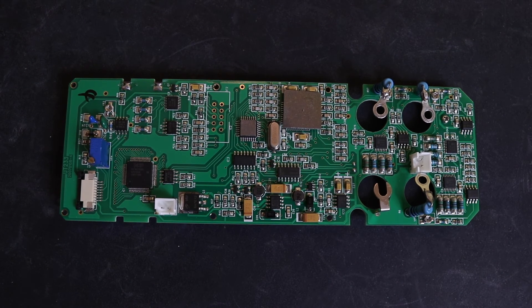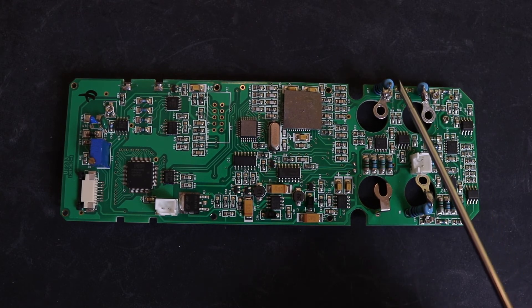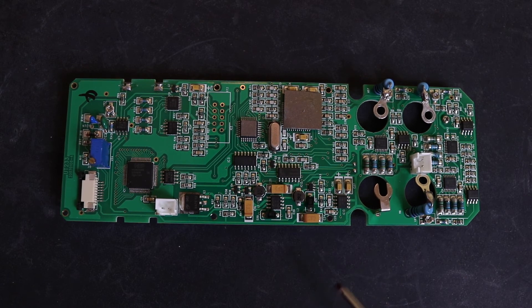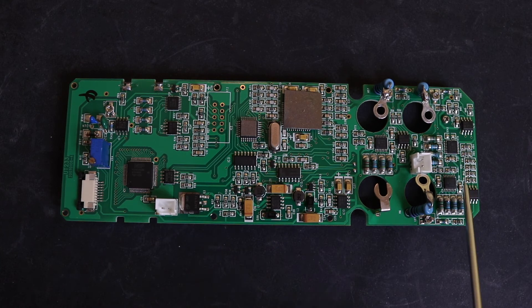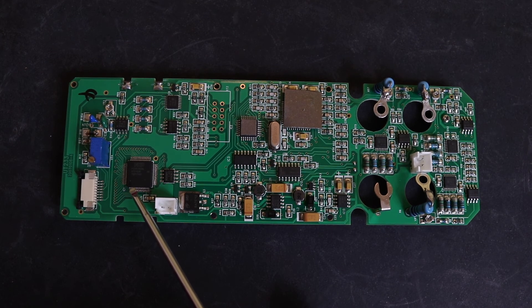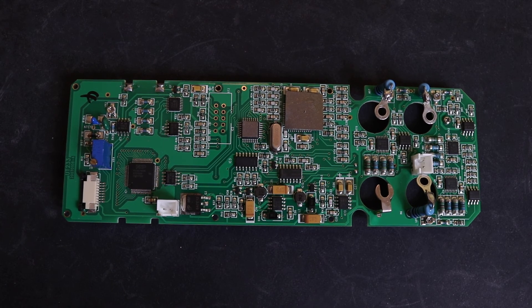I've had a good look around the board. I cannot see any input protection on the device other than these three dropper resistors. I don't know if that is sufficient enough for CAT4 protection at 300 volts. Usually on those kind of devices I'm used to seeing PTCs and gas discharge tubes, but I can't see evidence of any of them in and around the input circuitry. There are only some multiplexers I've been able to identify, obviously for switching of the analog signals. The little chip up here is from NXP — it's a PCF8576 — and that's the LCD driver. The main chip is underneath the pad here which is glued on, so I didn't want to remove that.